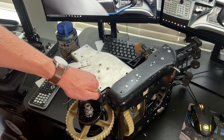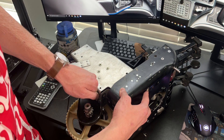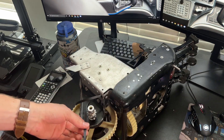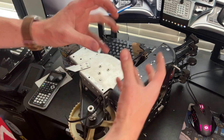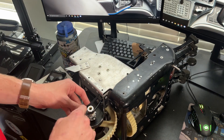It's important that the potentiometer doesn't slip around the shaft itself, so we need to tighten down the pulleys. It's also important that the pulley doesn't slip on the timing belt — those are the two areas we need to mitigate. I'm not so worried about slippage on this gear; you need a lot of force to mess with the calibration. This has to do with the shape of the belt and the way it fits into that piece, which means I don't have to 3D print a custom jig or disassemble this entire side of the panel. It works really nicely.